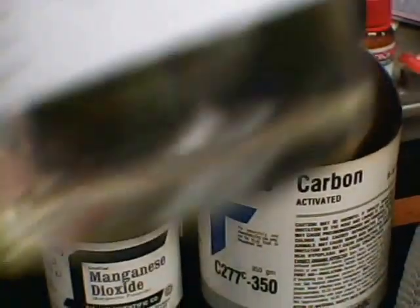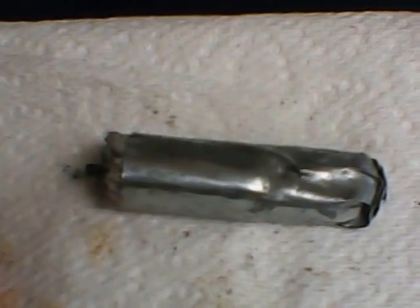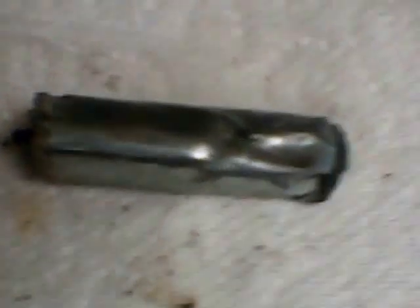I try different electrolytes — ionic liquids. This is a particular one I'm working on right now. It's a light yellow liquid made from levulinic acid and choline chloride, which is the latter — a B vitamin. I have videos that show you how to make them. There's also a YouTube video that shows you how to make an ionic liquid from urea, choline chloride, and ethylene glycol. But ethylene glycol, a component of antifreeze, is poisonous. Levulinic acid that I like to use here is derived from cellulose and getting cheaper all the time, but you may not be able to get a handle on it.